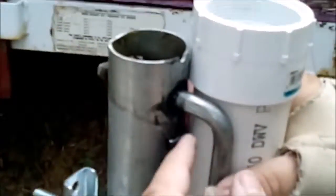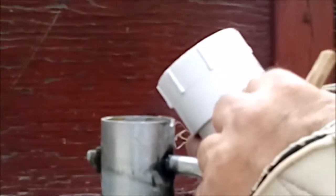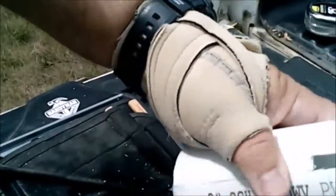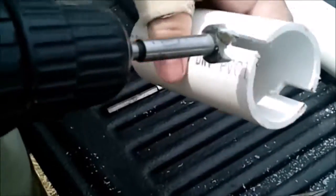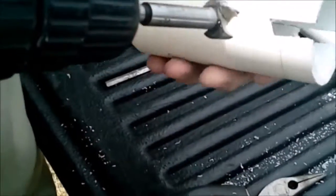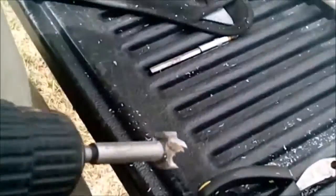It's a crooked cut I'm working with, but it's okay - it's gonna be inside, who cares. I can hold it against there and check the fit - yeah, that'll work. I can put this just below that line, so that's the top edge of where this piece is gonna go through. I've notched this - cut it down with the saw straight down, got the needle nose and busted it off. This is where the arms go through but it's just a little bit narrow, so I'm gonna use a file to open it up.